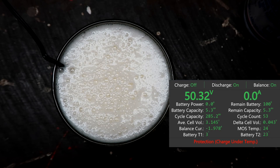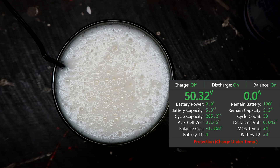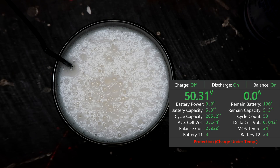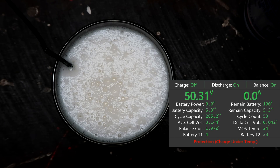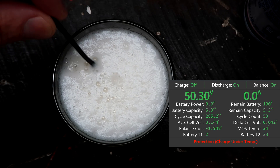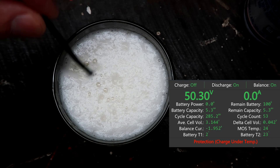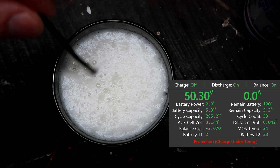What is our BMS doing? It has turned off. We've got exactly three degrees — beer temperature. Now we've got four. Yes, the current has turned off: 0.0 amps. If I stir the sensor a little bit, the temperature gets down to two degrees again. We are still under-temperature protected.